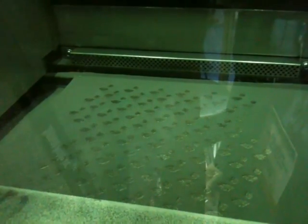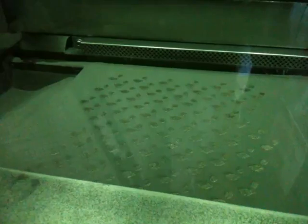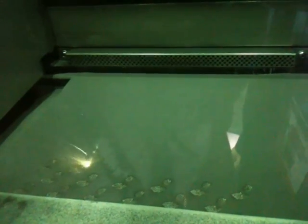This is an EOS metal machine. As you can see, the laser is fusing new layers of metal to previous layers. On the build platform, a re-coater spreads a very thin layer of powder, and then the laser begins working again, taking the two-dimensional cross section and fusing the new layer of material to the old layer.